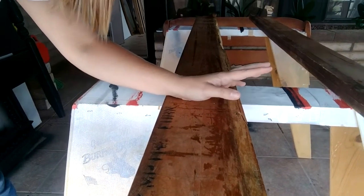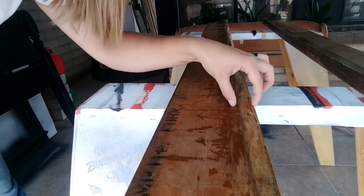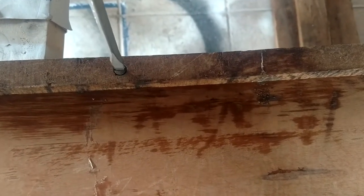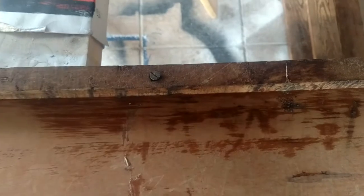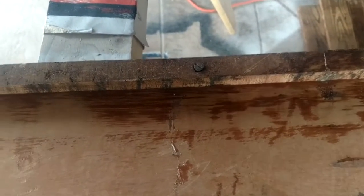So what we're going to do is we don't actually use a box spring currently. So we're going to move the lip that was here up here. Time to remove the old lip for the sideboard that the box spring will set on. Make sure you use a large enough screwdriver to where you don't strip the head of these old screws. These old screws strip very easily and then it becomes very difficult to get them out.